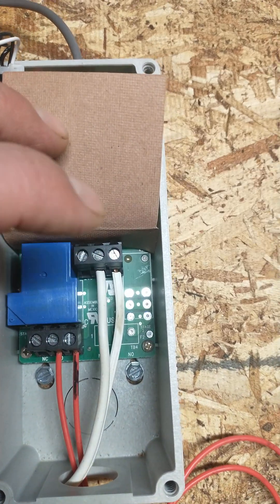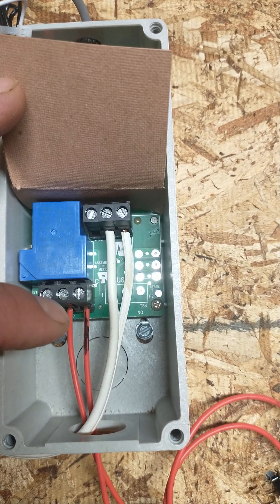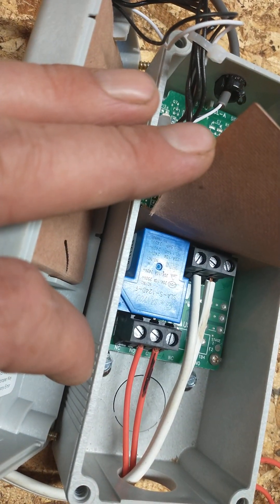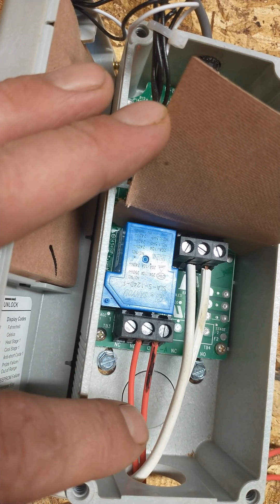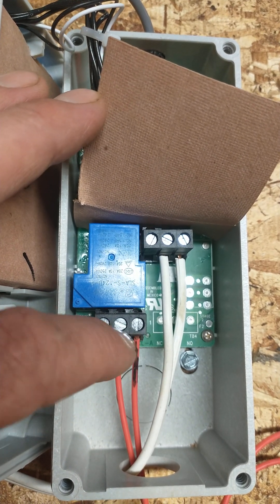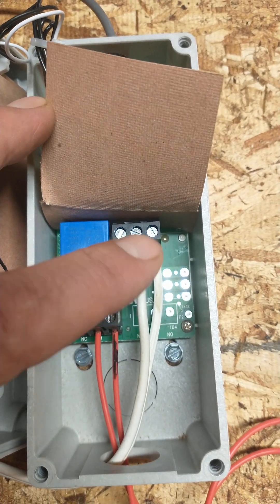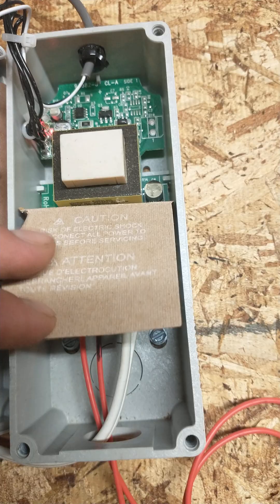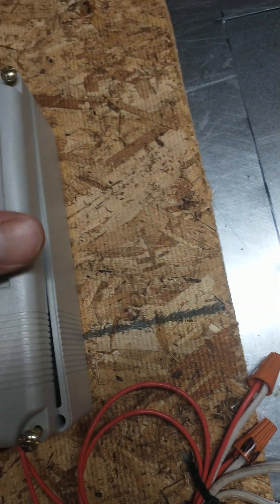You can also run this on 220 if that's what you were doing, but in this case we're not. The power to the fan goes through the relay at the bottom through the normally open terminal. It goes in at C — there's an NC and an NO. Normally open means it's open until the switch closes based on the water temperature. If you're replacing this controller, there's a jumper from the 120-volt circuit down to the common, it goes through the switch and out to normally open to the fan. If you're replacing this, just take out one wire at a time and replace it exactly like you found it — it's pretty simple wiring. It's just a switch that closes based on the water temperature.